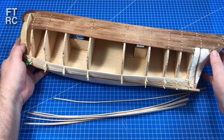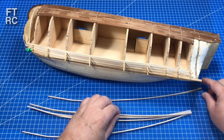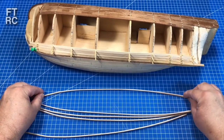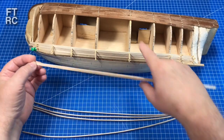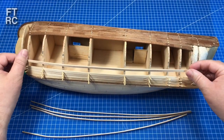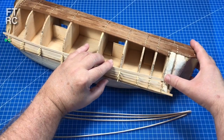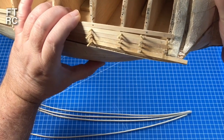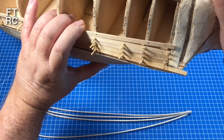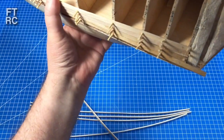I'd like to show you plank number five. Plank five has a bit of a curve — if I lay it down it springs up in the air — so they won't all be perfectly flat, they'll all have different curves. If I match it to the holes I've already drilled, you'll notice it doesn't sit right, it sits up a bit wide. That's because I allowed for a taper. Plank four was starting to strain a little when I held it into position, so when I got to plank five I let it naturally sit to see how much out I was — and I found I needed a little wedge.